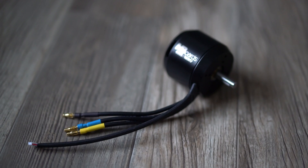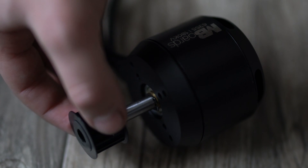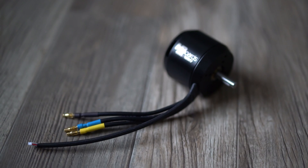The most exciting part to talk about is the motors — how big they are, how fast they go. If you've never seen one before, electric skateboard motors are cylindrical with a silver shaft coming out one end where you put a pulley to attach to a belt that runs your wheel. There are three phase wires coming out the back and most of the time a sensor wire as well. This one's a pretty big but fairly standard motor.